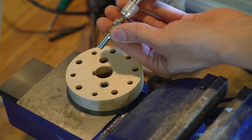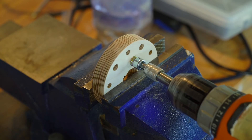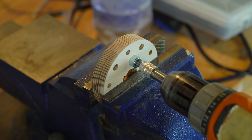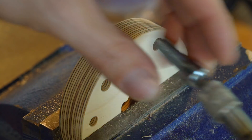Here I'm working on the center key — the one we just redesigned — and I'm putting some threaded inserts into it. We need to be able to pull this thing out with a lot of force, so that's why I'm making the threaded inserts.